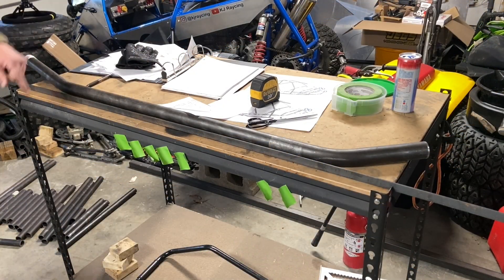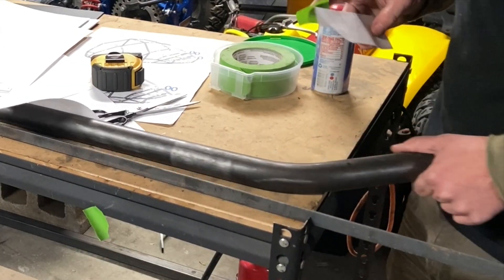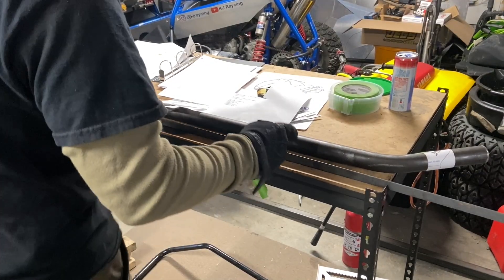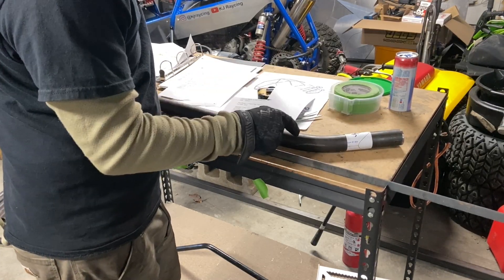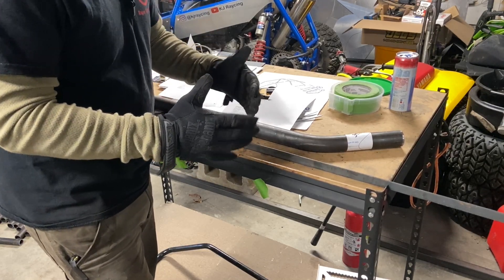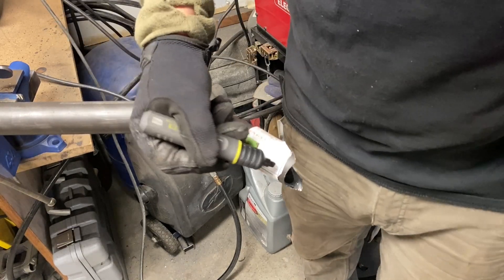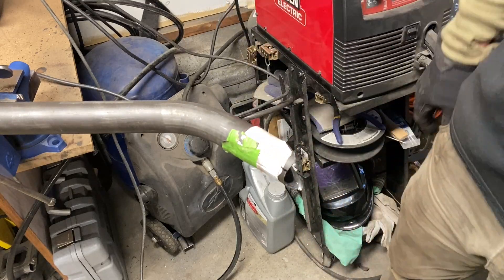The curved pieces won't give you a distance between bends — this one is five and three-sixteenths to the end. C3 is also the first piece that has setback. There's setback on pieces in the plans to make room for tubes to fit into your machines — a big thing I learned from making the first one is that you can't just design something and expect everything to come out perfectly; you have to design around being able to get pieces into the machine.